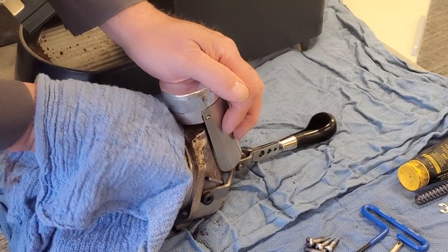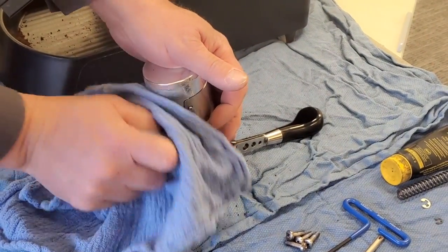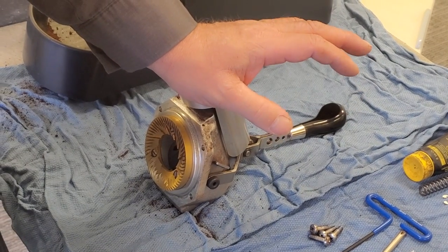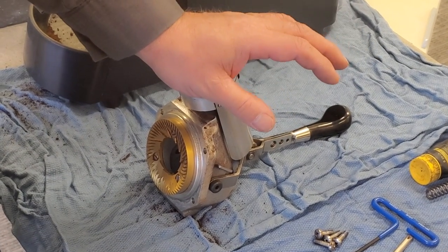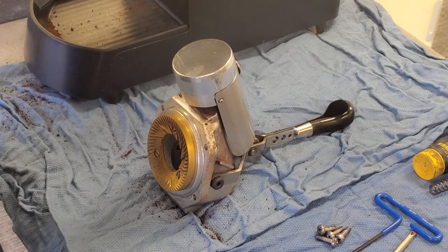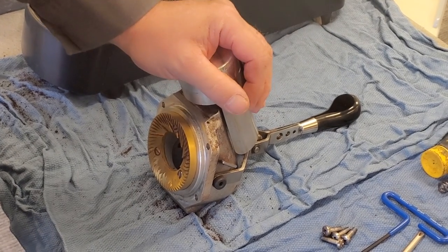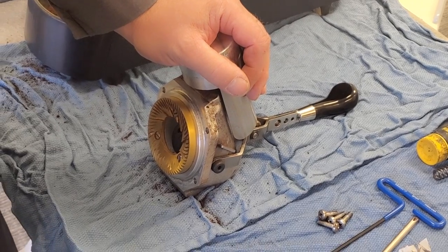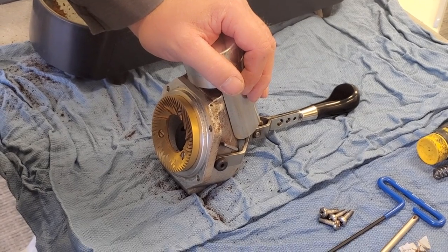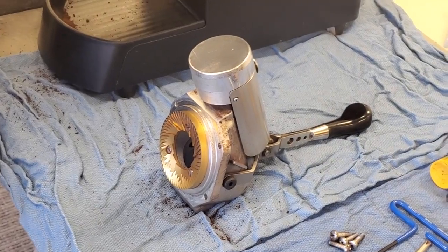What is the difference between a minor rebuild and a major rebuild? The minor rebuild is just replacing the two springs and lubricating. A major rebuild has a kit which includes a shaft, a ball, and assorted other components. A major rebuild is done about every hundred hours — that's roughly four minor rebuilds, or four service intervals.